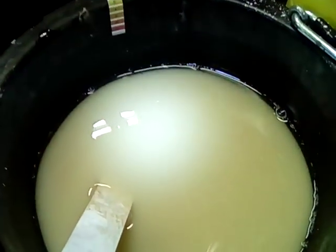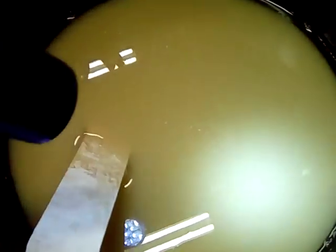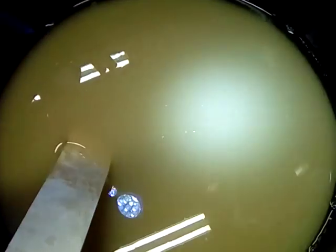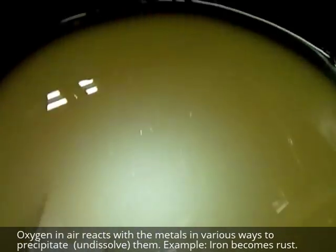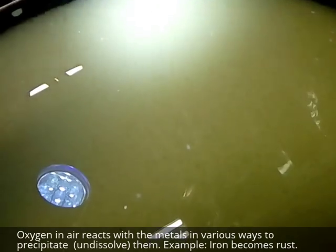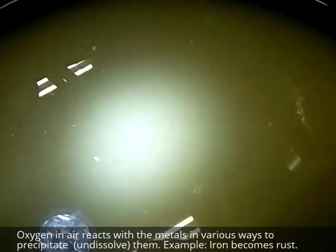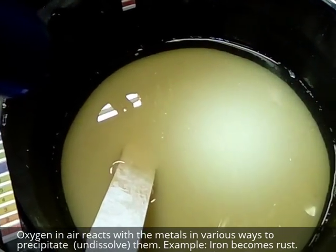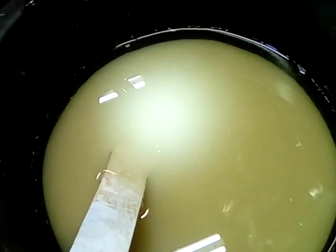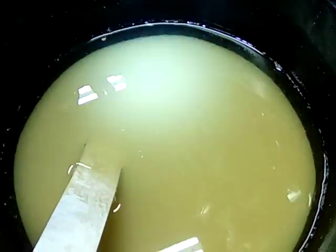In order to maximize the amount we remove, we can add air into the water. That will make the metals into hydroxides, which are less soluble. You could use a fish tank pump or an air compressor. You can see now there's a clear layer of water on the top. Like a big net, all the particles are flocculating and falling to the bottom, catching more particles. If you have a very low amount of particles in the water, sometimes they'll take sludge from another batch and add it to increase the concentration, because if particles are very far apart, sometimes they won't come together. In our case, it's fine.